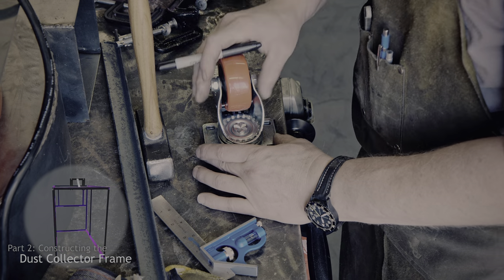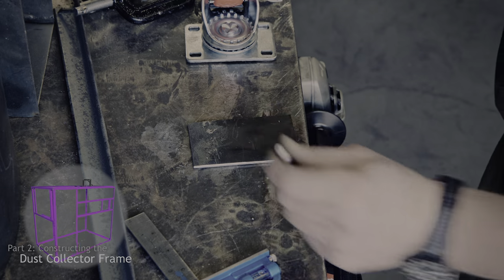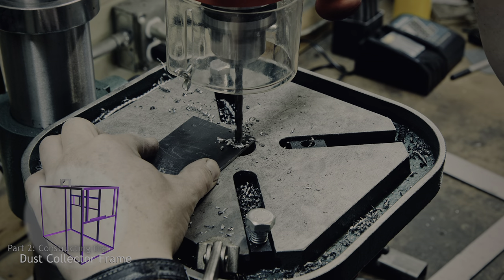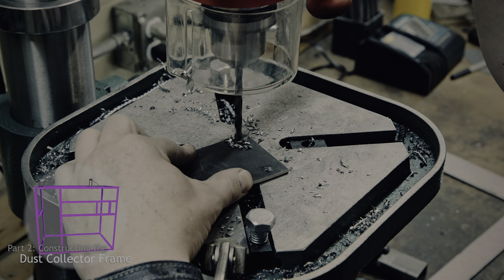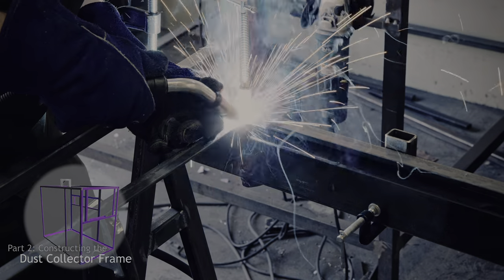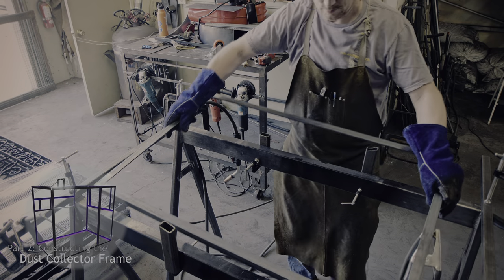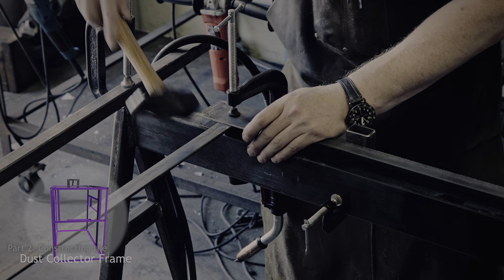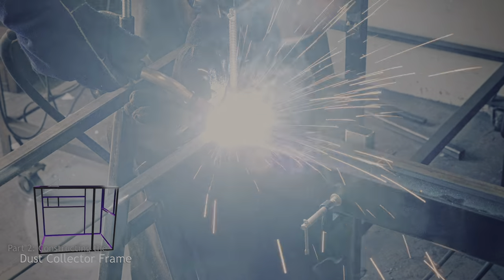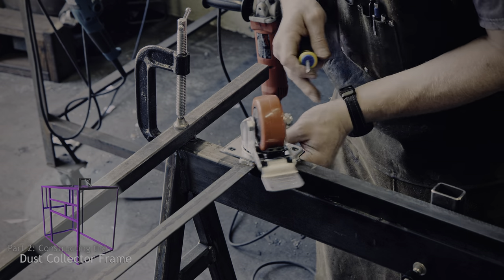None of this needs to be very precise. The most important bit is for the rollers to be level in the end. I am transferring the location of the screw holes to the plate and then will center punch and drill them. A drill press is really a great tool to have for drilling into steel. With a handheld drill, I usually blow out the holes by not being able to hold the drill completely steady. None of the welds here need to be particularly strong since they just need to hold the plate in place. The saw horses make it easy to hold the frame and to clamp the plate with the rollers so that it does not move when welding. Clamping also still allows for small adjustments with a hammer to center the plate against the frame. After some cleanup, it is time to attach the rollers and see how it all fits together.